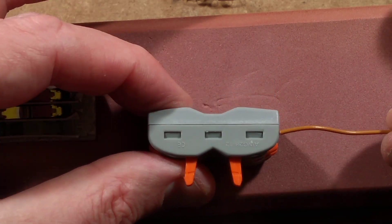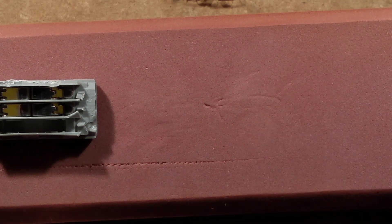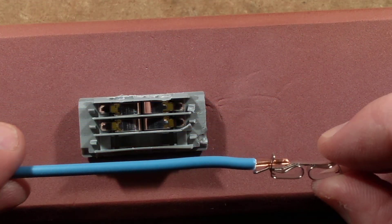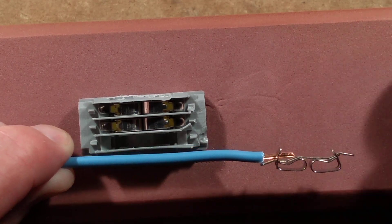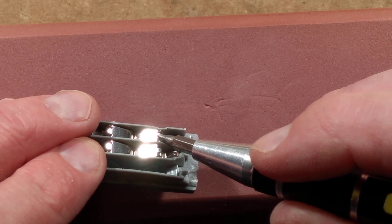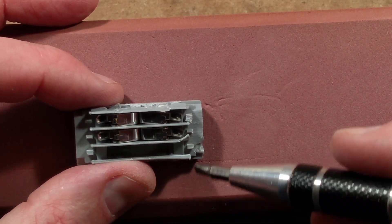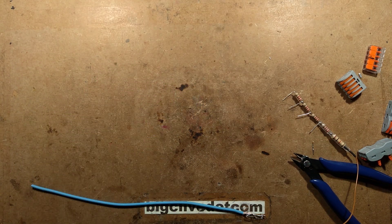With both levers up, can I just poke a wire right through? The answer is no - it does seem to find some sort of limit, though I'm not sure what stops it going further. Regarding applications - one niggle I have is the closeness of the terminals. There is a barrier between them, but technically speaking if they get wet, it could cause tracking. If the middle terminal is earth and live and neutral are either side, it could cause an RCD to trip - though it's a petty niggle and I don't think it's actually a major issue.